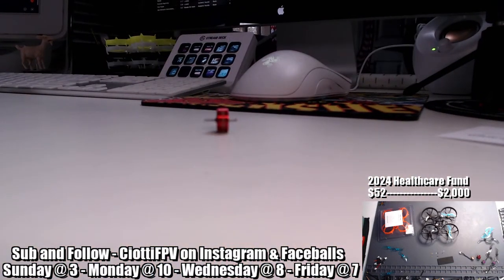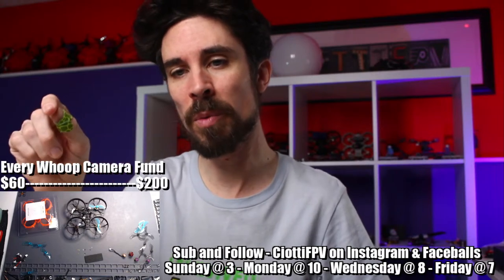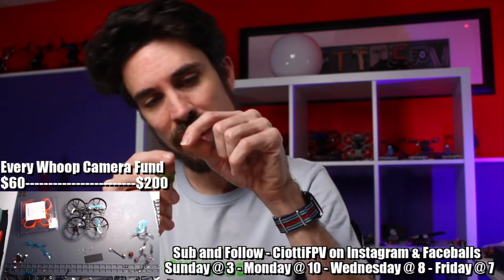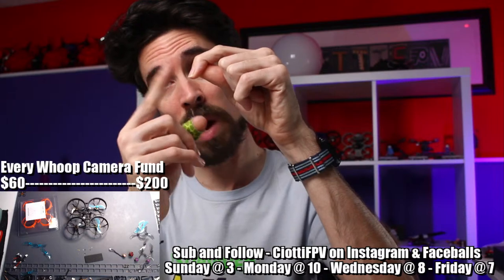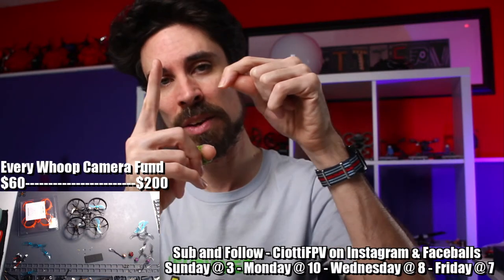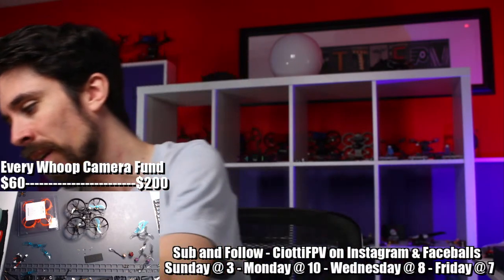Oh, yeah. Oh, boy. My favorite way to test this is to put them on a rig, no props on, and then spin them up really slow in the motors tab, and just look, and you'll see the motor shaft wiggling back and forth. If you can't see it, take your fingernail and very gently put it against the motor shaft, and if it's wobbling, you'll feel it tick, tick, tick, tick, tap your finger. You don't want that. You want to be able to touch your finger to it and have it be a constant touch, rather than tapping your finger.